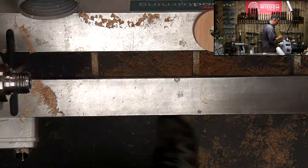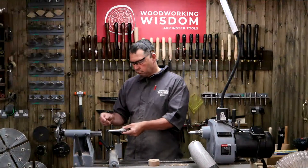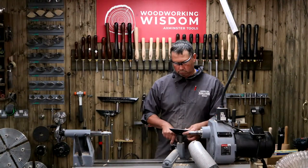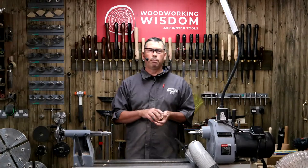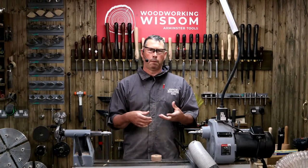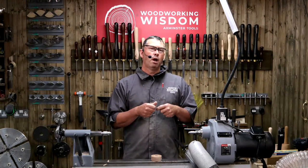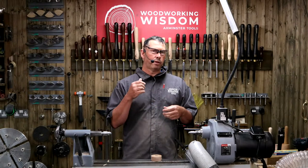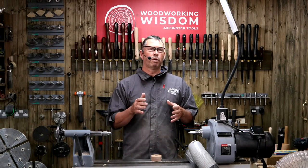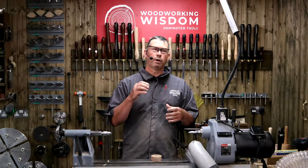Yes, Craig, another question? Yeah, question from Terry. When polishing wood, is there a special mop, stitched and loose? He's seen some are different. Yeah, so if you're going to use polishing compounds, like Triple E, Triple Max, Buff, Plastimax, all those sorts of things, go with a stitched mop. My preference is to go with grade G. It's a little bit softer than the B's. For those materials on timber, I find it works better.